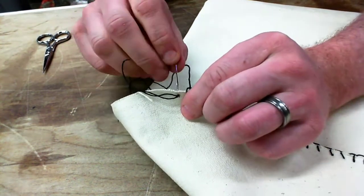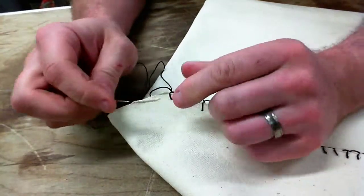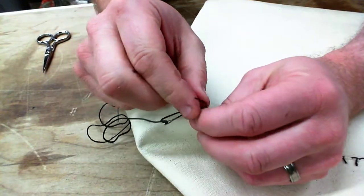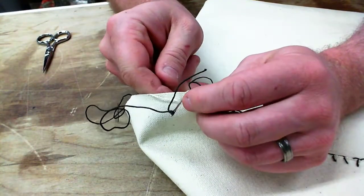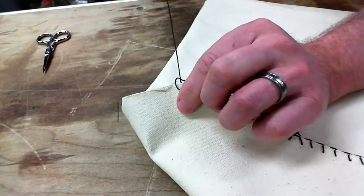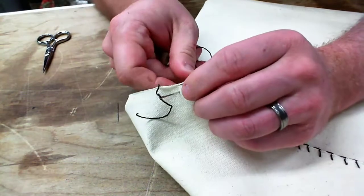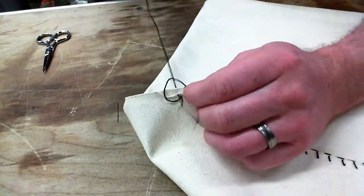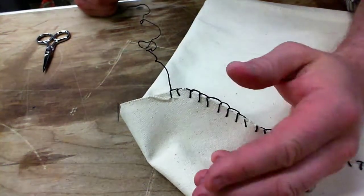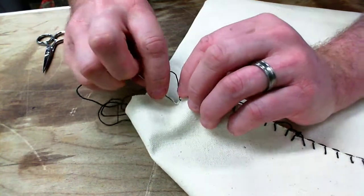Yeah, granny knots spin. They don't lay flat, and they can slip. Square knots are great for joining two pieces of similar line from their bitter ends. So the cut end, the end of the rope, is the bitter end. So if you want to extend something, it's great. Or just join two pieces together. The bowline is for your loop. You then have to know how to make off a couple of different bits or points. So tying a rope to a thing on a boat, whether that be a cleat.